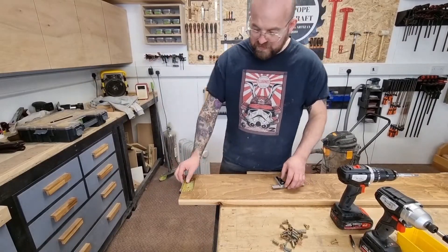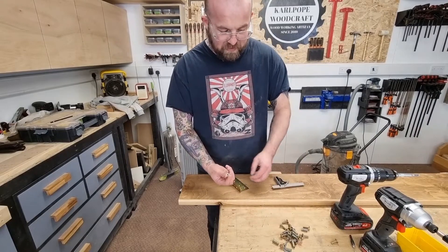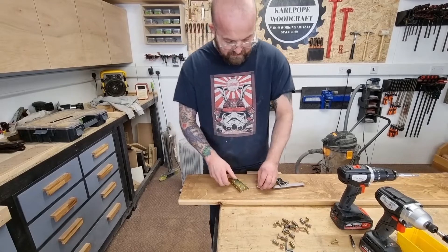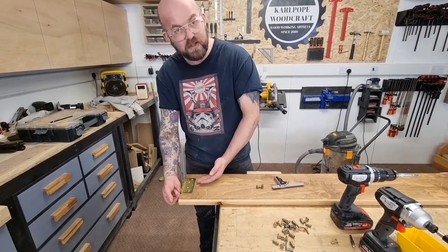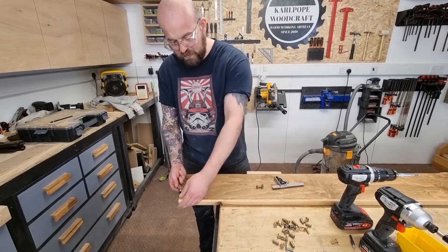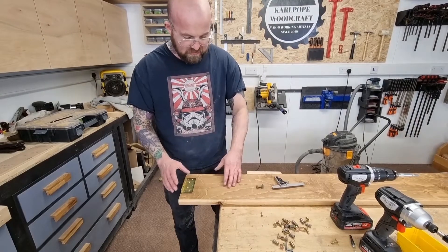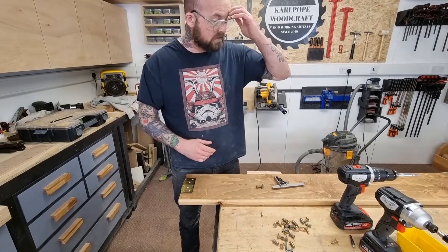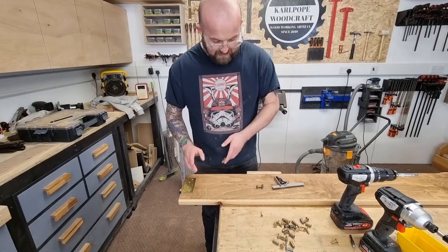To attach the rails to the head and the foot I have these simple but excellent bits of hardware called Bedlocks. You get one insert to put in the posts and four screws to put into the rail, and then the bolts also go into the posts into the inserts. They're super solid. I like to put them a couple of millimetres back from the edge - that way you ensure there's no gap if the metal is just touching the posts before the rail itself. As you tighten the bolts up, it pulls the rails really snug against the posts. Super strong, no wobbling whatsoever - when you put the bed together it's rock solid. Not like those clip-together ones that hook onto each other - those are terrible. These are spot on. I'll put a link in the description. I always use these exact ones.